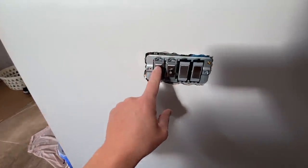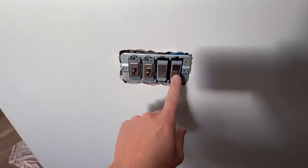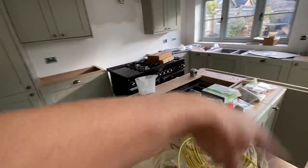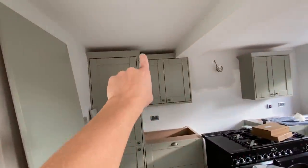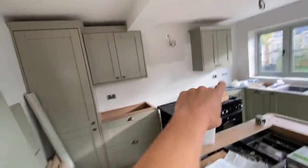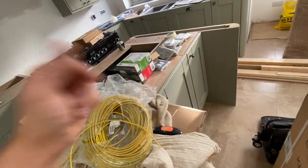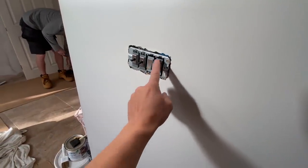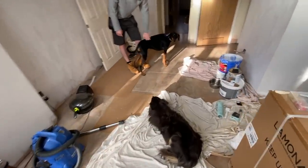We've just done this switch - we've got the V-Pro grid system. This is two dimmers, this is a kinetic switch and this is a normal switch. One dimmer is going to do six spots in here, the second dimmer is going to do a pendant over the island, and the third is a kinetic receiver mounted in that back cupboard to do some LED strips. That switch there is going to be a kill switch for a colour-changing LED tape along there. James has got two dogs with him - three apprentices today!